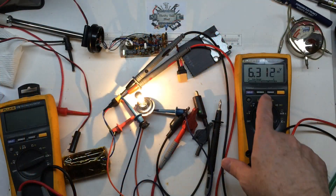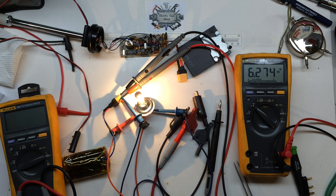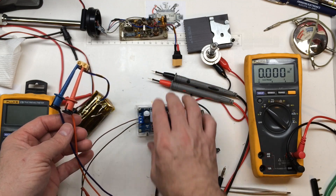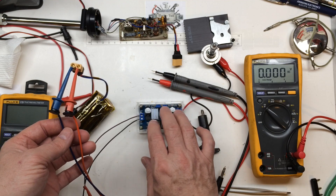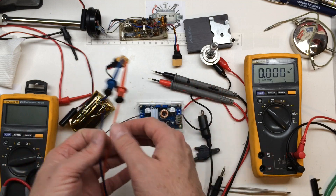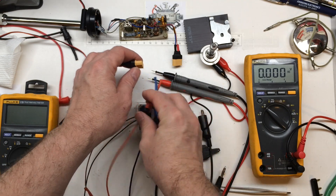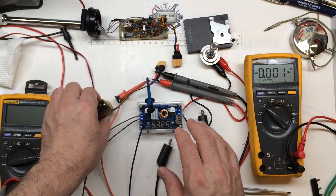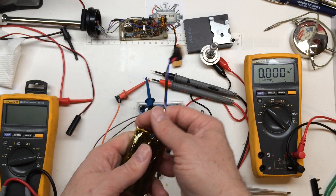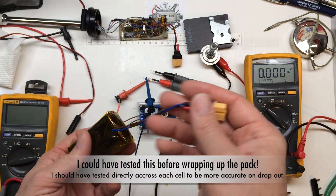Just to be on the safe side I'm going to put a heat sink here to help take some of the heat off. Down to 6.3 volts and still pulling down. I've tried several methods of pulling down the battery — using a small buck regulator as an adjustable electronic load basically — and as soon as I dip below 6 volts it activates and shuts the pack off. Somewhere between 2.8 and 3 volts per cell is what it's picking up and triggering the shutdown. Very happy with that.